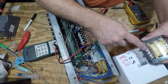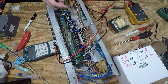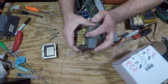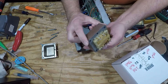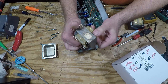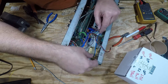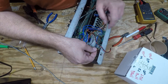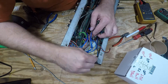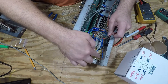The schematic shows 9, 10, 11, 12, 13, 14 — but this transformer is ordered 9, 10, 13, 14, 11, 12. Don't let that fool you. Here's the old one, T401S — you can see where it looks like it got kind of hot right there. Got the new one in. The only part that would be confusing is these first two wires coming from the AC input circuit board: brown on pin 2 and blue on pin 6.